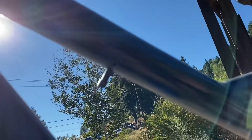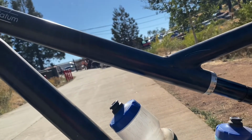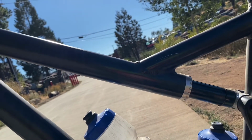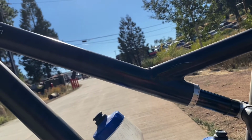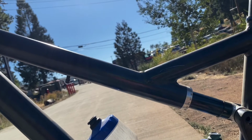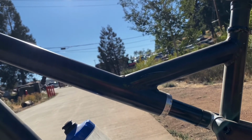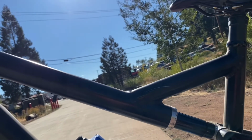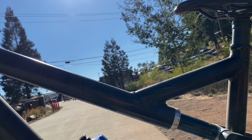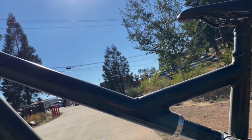The reason I haven't got the adjusters here in the frame is that, in tuning this prototype, I've not been giving myself the easy way out of just turning the dials. For developing the prototype, I've been adjusting the shim stacks and the piston ports and getting the valving right fundamentally on the inside of the bike. I'm kind of a middle-of-the-road rider in weight and riding style, so I'm going to dial it into middle-of-the-ground performance, and then we're going to add in the adjusters, which will allow people to open up those brackets to the faster and slower sides. And ride perfection will be yours.